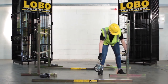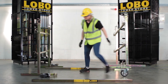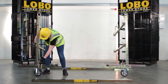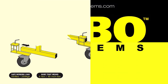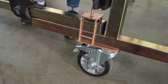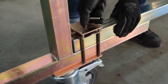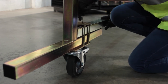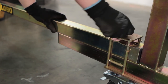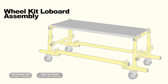Wheel kits are available for systems on trestle legs and base plates and come in different sizes to correspond with the low board length. Remove the wheel from the wheel kit and, by lifting the trestle leg, insert it onto the foot of the trestle. Repeat to place an additional wheel on the same side. On the opposite trestle, take the connecting square tube and insert it into one of the wheel top clamps to secure the wheel in place — tighten the elbow. Repeat the procedure for the two legs on the other side and fully tighten all elbow bolts. Once the low board has been refitted, always ensure the brakes are fully applied before using the system.